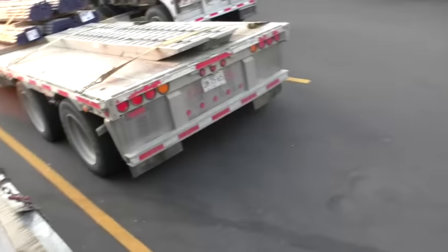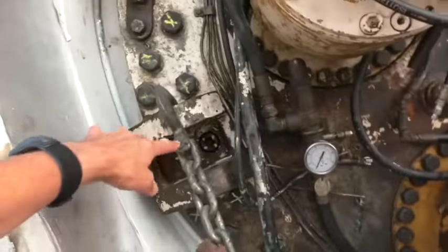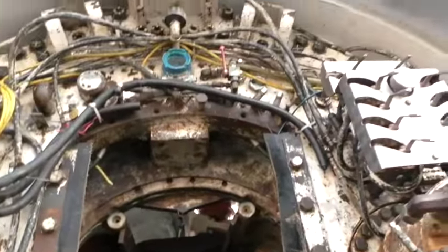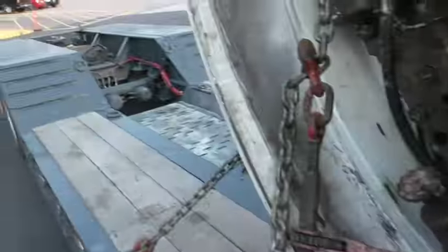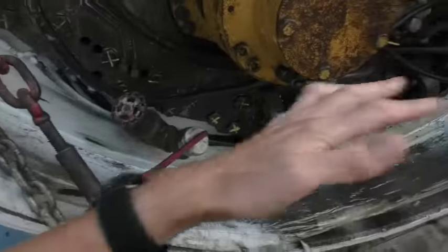The machine that powers this connects over here — that's where they have all the eyes and millions of hoses, hydraulics. Very unusual piece of equipment, very tricky to load. I did a quick calculation: 32,000 times 2.2 is about 70,500 pounds. I definitely needed more than four chains. At first I put two chains on the front and two on the back, then when they scared me with the weight I added two more on each side. Now I have four pairs of chains, good for about 80,000 pounds.